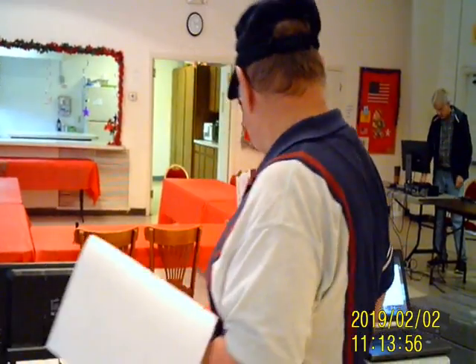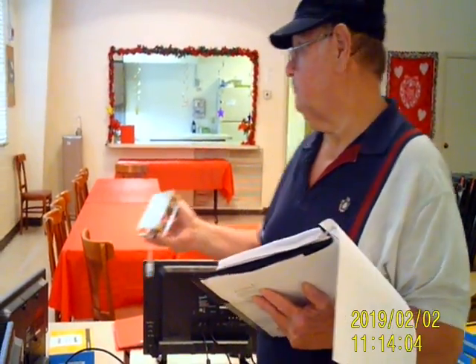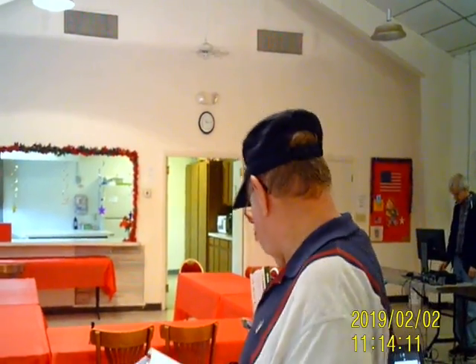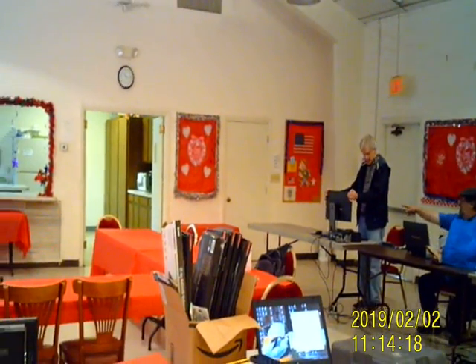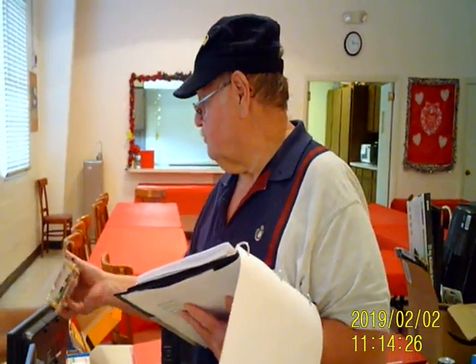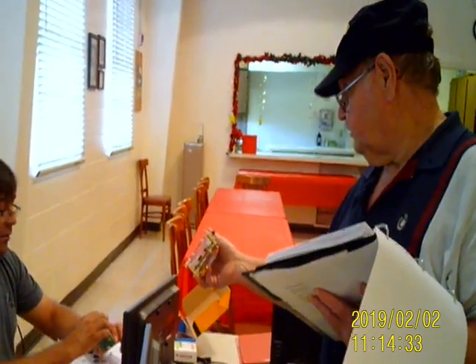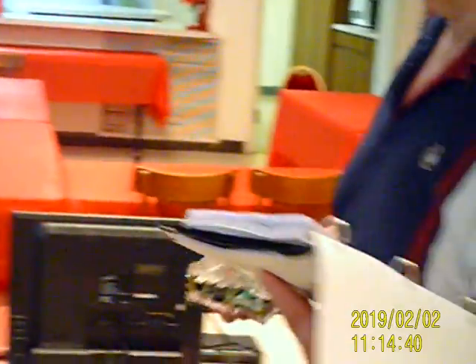At the one o'clock position is the one gigabyte RAM — it's located on the bottom. You'll see the cover I have here, but they're just a black chip. This is just a heat sink I put on. Right beside the USB I've got — it might be covered up with blue on this one — this is the LAN hub internet chip. It does dual duty. 300 megabits is still pretty good throughput for something this small. It's about a 50% increase over what they had before.